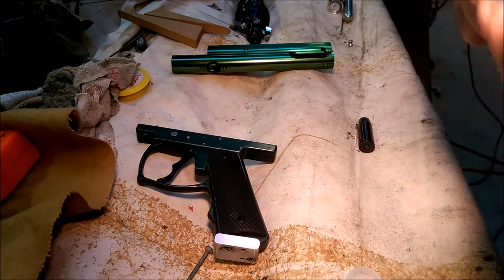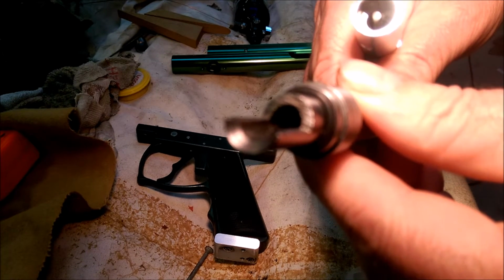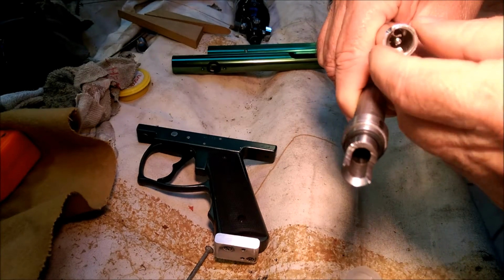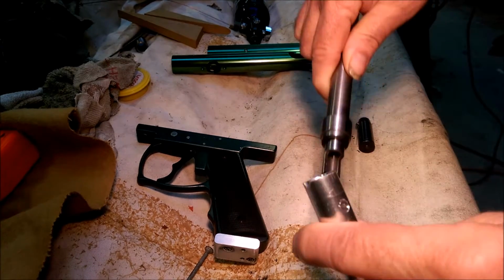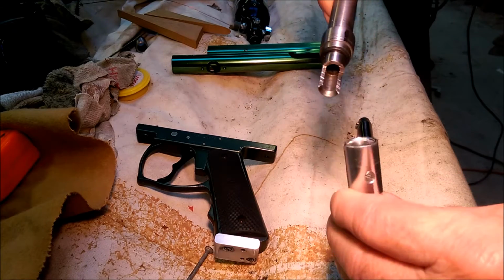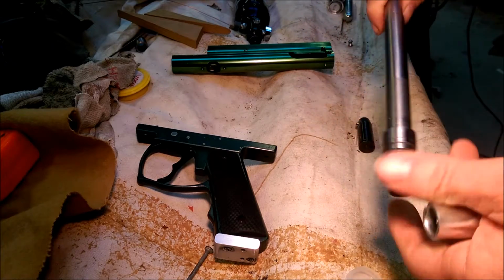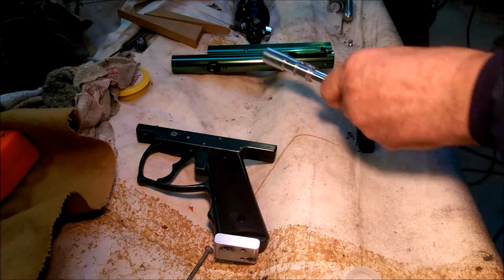If you look at the barrel, I've actually beveled the back side of it right here, to help get the air in there. And then when these slide together, that top half fits over, and closes up as much void area as possible. And then the rod, of course, pushes it up flush to the end of the barrel. But that's about it on this.